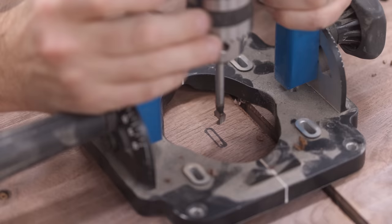I've got the top all mocked up — not actually glued on yet — and I've got the tambour down the groove. I realized I kind of overlooked something: on this edge where I wanted the pull to catch, I forgot to account for a gap you can still see. So I'm going to take this extra piece, cut off the ends that ride in the groove, and glue that here to give me a little spacer to close that gap. This bothers me because now that first strip isn't continuous grain, but when the cabinet is closed it'll be hidden, and when the cabinet is open the rest of the door is hidden — so it's just a little detail that only exists to drive me crazy.